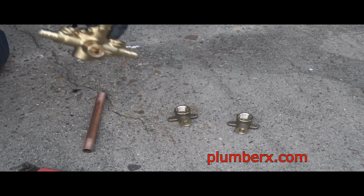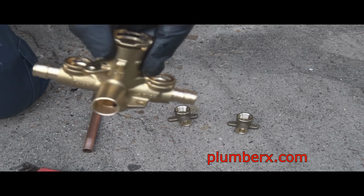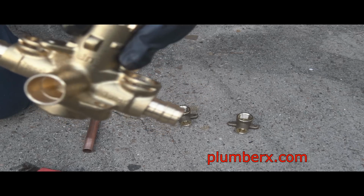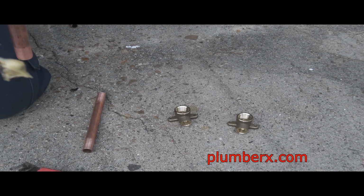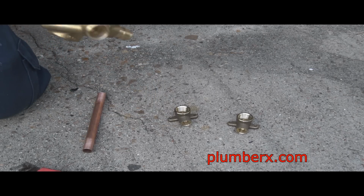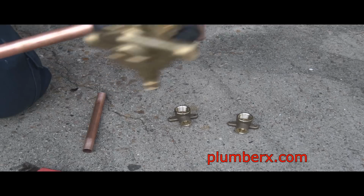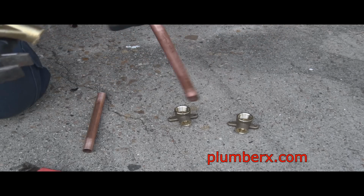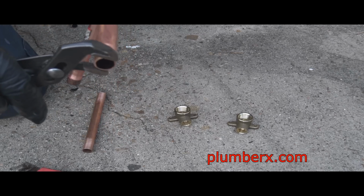And by the way, this is probably the most copper pipe soldering that's going to be done on this job site. Other than that, everything's going to be PEX. But there are areas where you'll see copper, and this will be one of them. And then you'll see galvanized pipe on the stub outs. I'll show you those later and throughout the video. Galvanized stubs out because we want some type of rigid pipe.